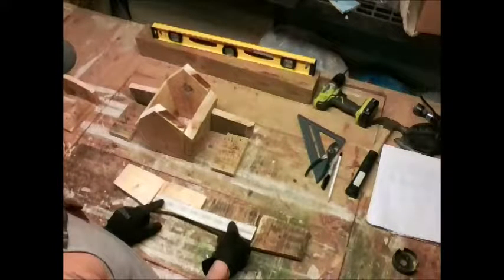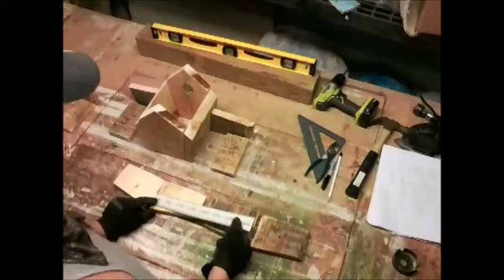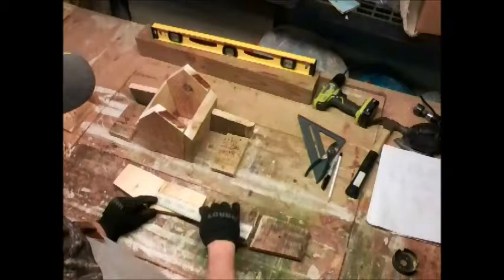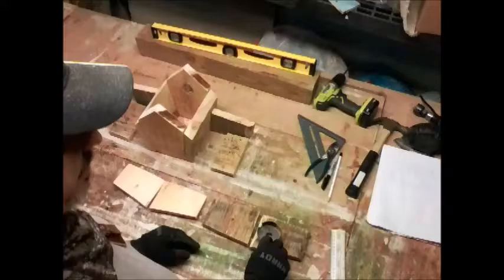So I've measured from when I've cut them out, I've measured it from the inside. So you want to measure from inside out to give you where I'm going to put the entrance hole, which some people call windows, but obviously it's the bird hole. I got it from 3 inches from inside out, and then from the bottom you go 1 3/4, and that gives me your center lines right here, where I'm going to put my 2.5.